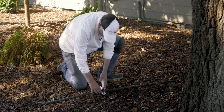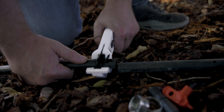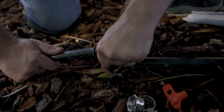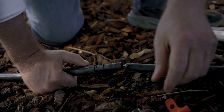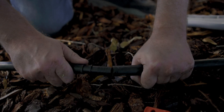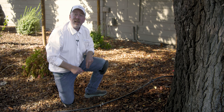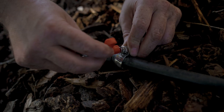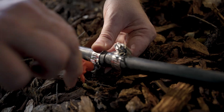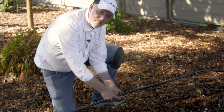I'm going to cut out the damaged section as close to the damage as I can so I don't waste too much of the tubing. Cut far enough away that you can make a nice, clean, even cut on both sides. Now I'm going to use this barbed coupling to join the two undamaged sections together. Once I have the barb inserted on one end, I'll add clamps to each end of the tubing before inserting the other end. Once you've got the tubing all the way over the barbs, it's time to tighten the clamps. These are simply steel worm gear clamps — you can use a flathead screwdriver or the hex end of a key punch. You'll notice I put the screws on opposing sides to even out the pressure of the clamps. Sometimes you might even use two clamps per barb, and when you do, it's also best to make them opposite.